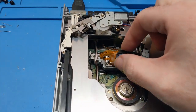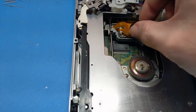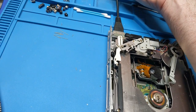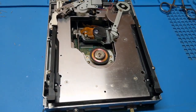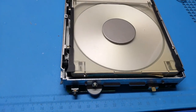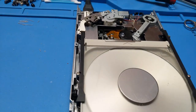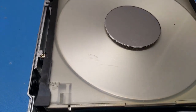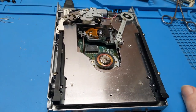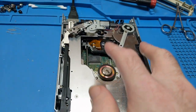Board's back in there. I need to check clearance — make sure it's not rubbing. Alright. Now we just put the disc in and see what happens, see if we can obtain disc servo lock. Nope, definitely not. But I got different behavior — it just rejects it immediately though. One of two things: we're either going to have to retune this thing, or those two ceramic caps I put in the servo circuit are a problem.